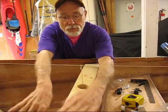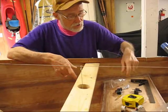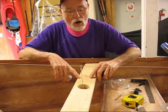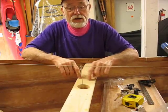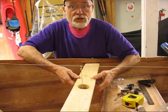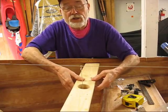I've got the mast partner back in place with the new piece of plywood stiffener to give it a little more strength. I've been marking out some of my jam cleats and my little turning block, and I wanted to drill some pilot holes — mark them off with your sliding square to get everything evened up. Then I'll take them off and use my regular old brace and bit to drill some holes on the back side in order to hide the nuts up in there, so I have a smoother bottom on it and they're not catching on anything.